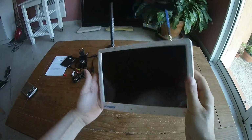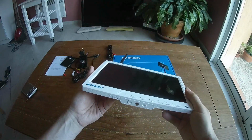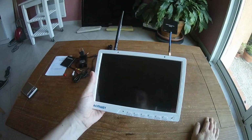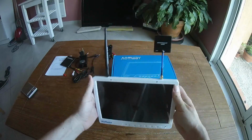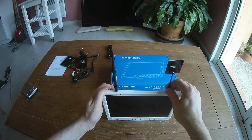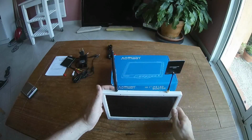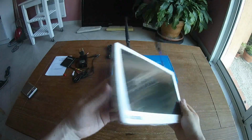Really what I like is also the general RX sensitivity, minus 95 dBm. It's pretty good. I also like the fact that now they include, instead of 2 linear antennas, half planar ones, more adapted for long range. That's cool. Really a lot of positive points.